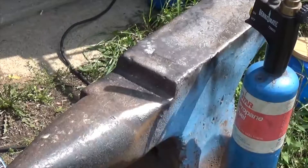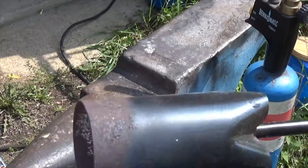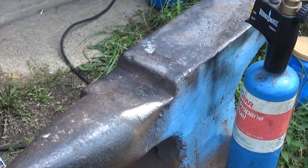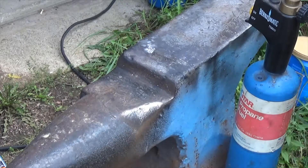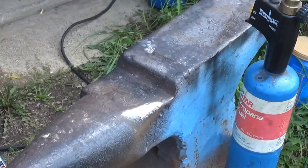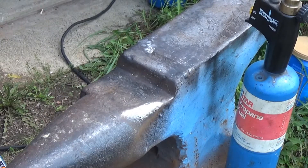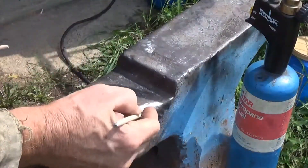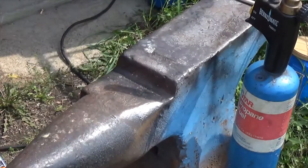The tools for this: I'm going to heat it with my LP propane weed killer torch, then start welding. My welder is a Maxi Star 140 from an estate sale. You'll need welding rods and a grinder — I've got a nice six-inch grinder. One trick I learned: take your rod and cut it in half so it's a lot easier to get in here and work. This is all cleaned up so I'm going to go ahead and start heating.